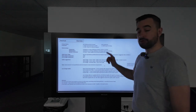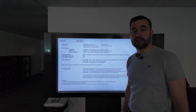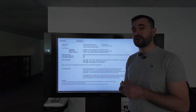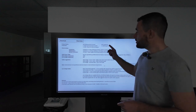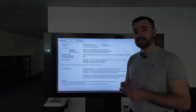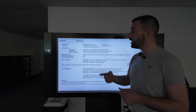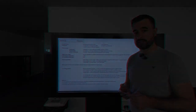The Castletown has two 16 amp supplies. The Cartmel and Rothsay have a 40 and 32 amp supply. The reason why we have two supplies is: one is for the heat pump itself and the second supply is for the booster heater. So the Castletown has a 16 amp for the heat pump and for the booster heater, while the Cartmel and Rothsay have a 40 amp breaker for the heat pump and a 32 amp breaker for the booster heater.